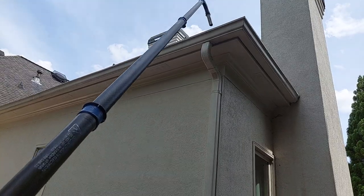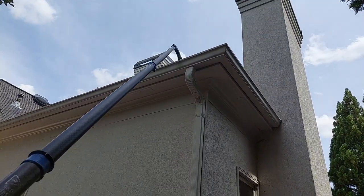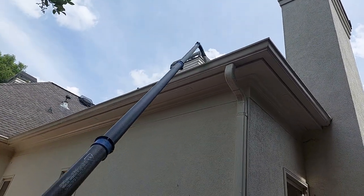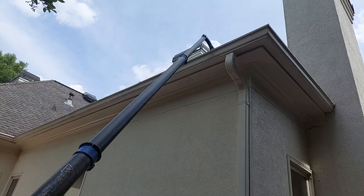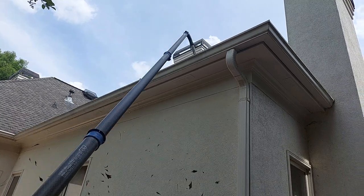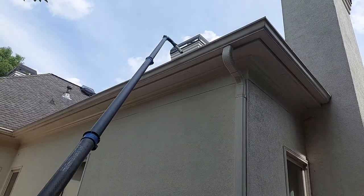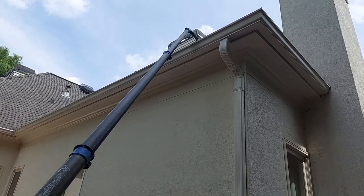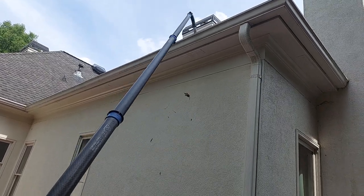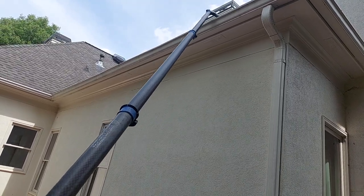Basically it's very, very light - no forcing. Every time something gets on it I just lift it up and vacuum release. It's not that hard; the machine does all the work. Sometimes it won't release when you vacuum, so you activate your vacuum and just tap the gooseneck on the roof and it should go right in. But you don't want to force debris into the gooseneck.